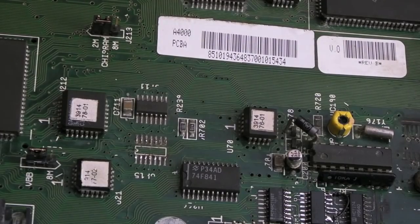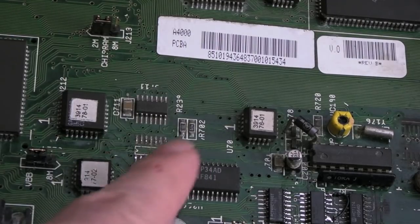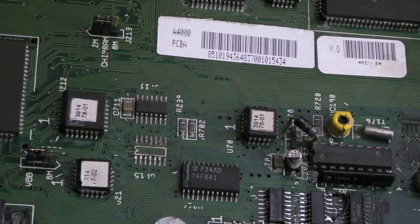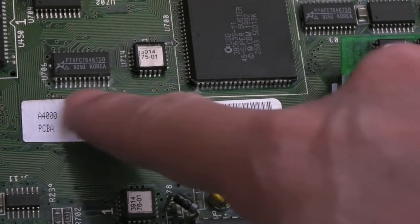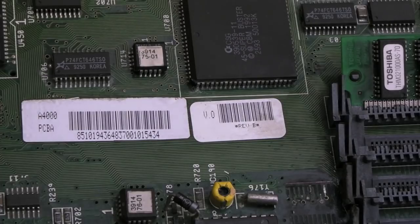So over to the second board. I'm just going to clean up the pads here and refit replacement 04. I'm going to try and start working back on this board again now. You can see I've left it for a few days. Can you see we've got some corrosion? Some of these things are looking a bit white and furry again. This one, again, is just at the moment showing no signs of life at all.